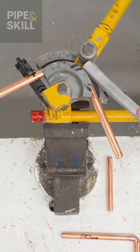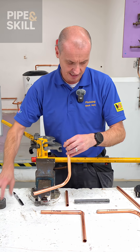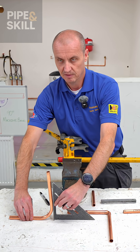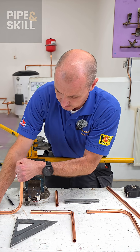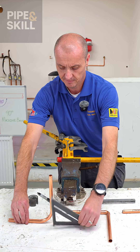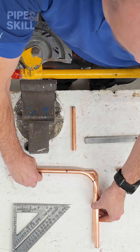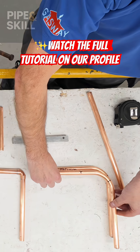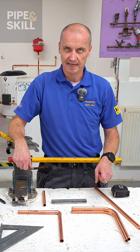I can stretch it, take it out, make sure on a flat surface — 90 degrees. Fold it down, they're a bit over. All we do with that is fold it back, stretch it out a bit. I'm happy with that, fold it down, then I can check it with the one that I've made fitting. I've been 190 mil long — I'll check it with the one I did earlier. The exact same, and I haven't wasted anything with the 90 degree bends.